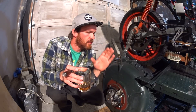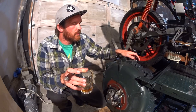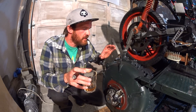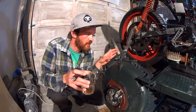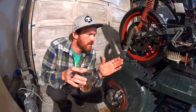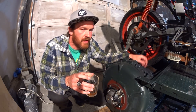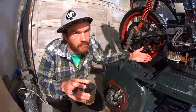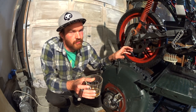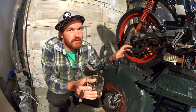One great thing about doing it this way is that you have the bearing assembly with the rotor and the shell all in one part, so you won't have to fabricate anything — it's already there. Another great thing is that you won't have to calculate the inertia of the roller. All I did was contact ABB and they provided me with the numbers. The inertia of this particular rotor is 2.17 kilograms.